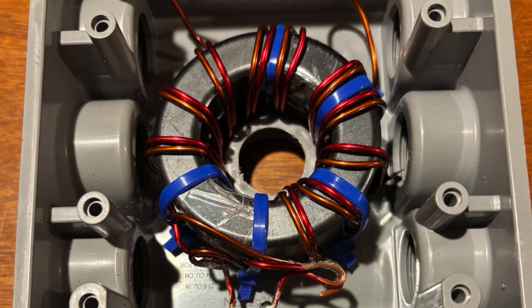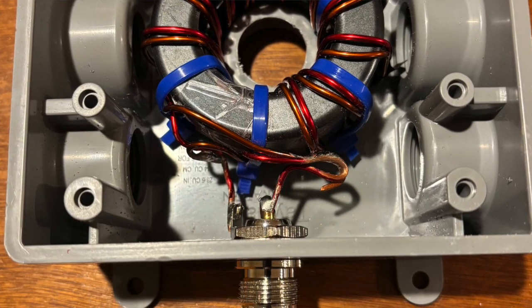When I got it done and the wire put on and trimmed up, I have to say I was very impressed with the Delta Loop — very impressed. It was usable on 40, 20, 18, 15, and 10. I was shocked at how usable this Delta Loop was, so much so that I decided I needed to build myself an 80 to 10 meter Delta Loop.